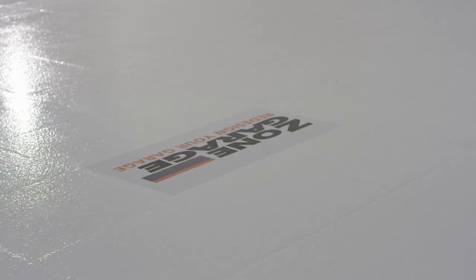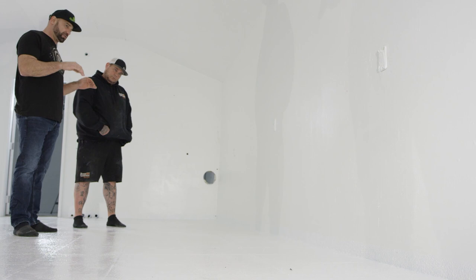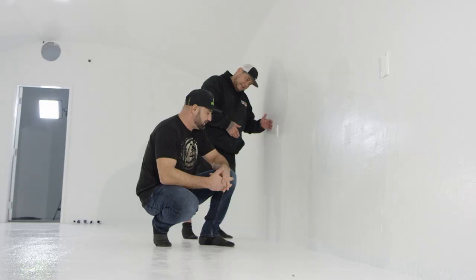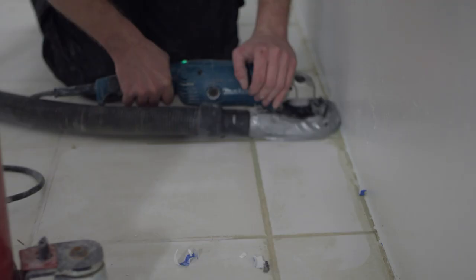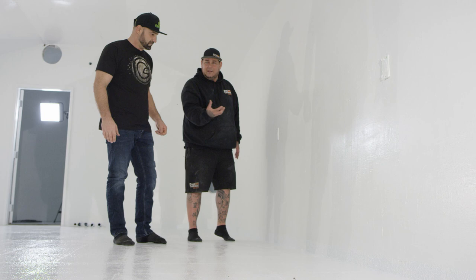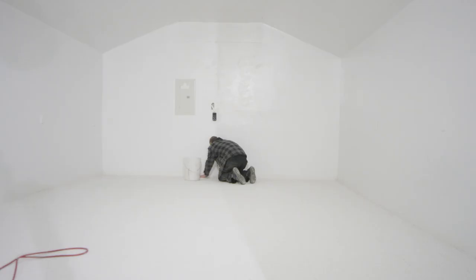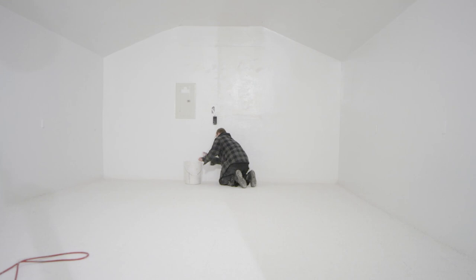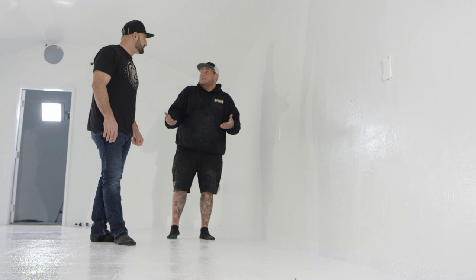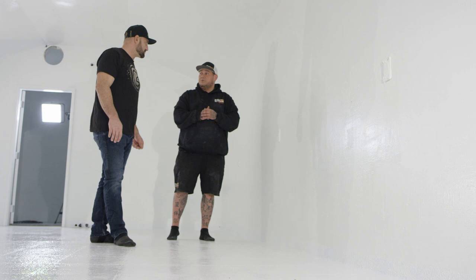You can actually still see the grout lines, but they're completely sealed and it gives a really cool checkerboard look. I'm really happy with the final product. You're actually going up the wall with this product too. What we've done here is eliminated any sort of opening between the floor and the wall — we've gone up about three inches high around the whole room. We sealed it prior, then base coated it up the wall, then flake, scrape, and top coat — the same process as the floor, but now we've kind of made it like a bowl. It's eliminated any gapping and any opening within the floor so that it is sealed. So any water, if we do have a flood, it's literally going to go out the door. It makes cleaning easier — you're not going to get water underneath the floor, which in time could affect any product you put down. Now we're going to put the PVC panels on the wall and we have a completely airtight, watertight seal.